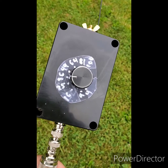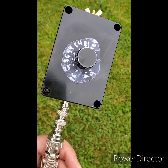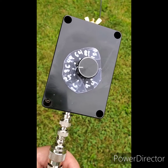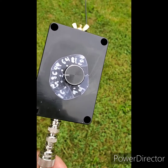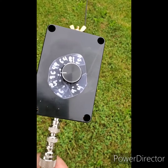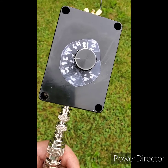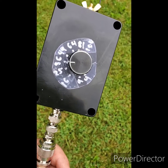On 20 meters, 49-to-1 worked the best — got it down to 1-to-1, almost exactly. And on 15 meters, this works best on 36-to-1. So this way, if I'm working different bands, I can just memorize which band goes best with which transformer impedance transformation.